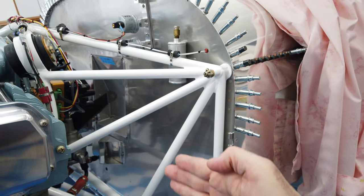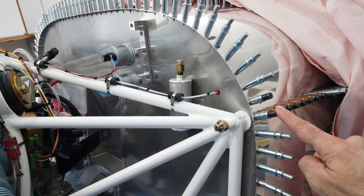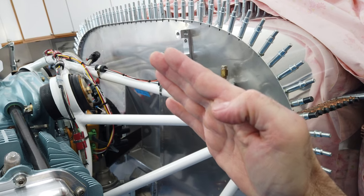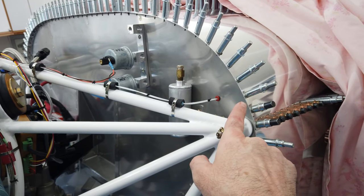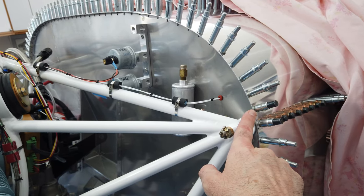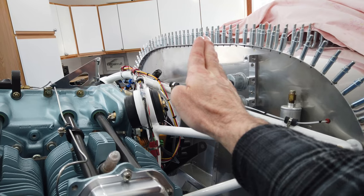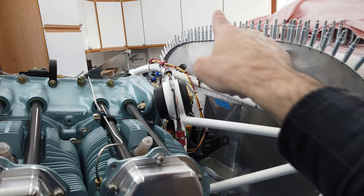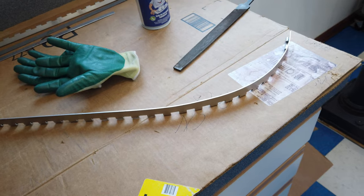The firewall comes up flat and then bends forward right about where these clecos are, so the hinge needs to stop before that forward bend. My hinge is going to stop at this cleco. From that cleco all the way over to centerline plus 6.5 inches gives me the length for this hinge and the matching shim.